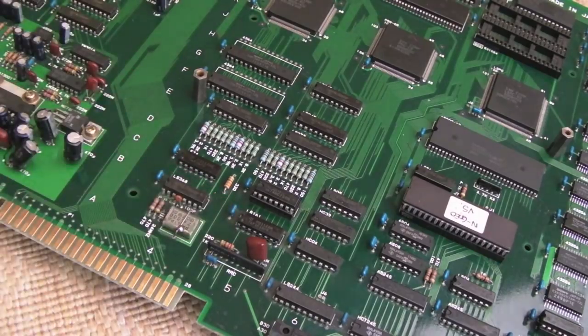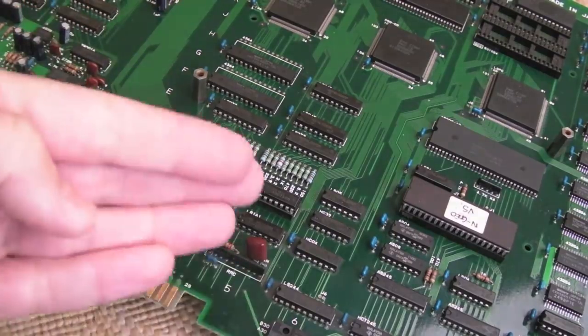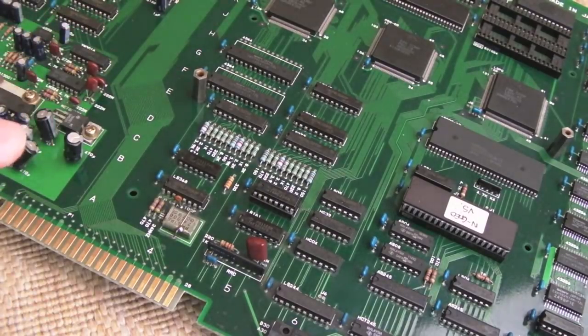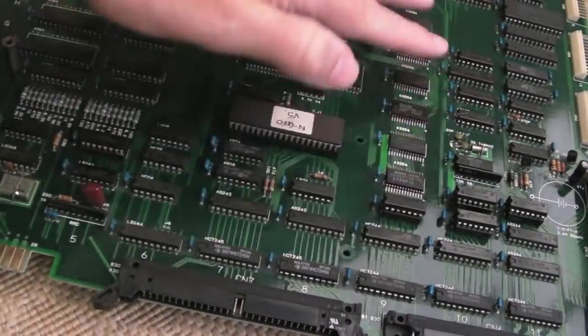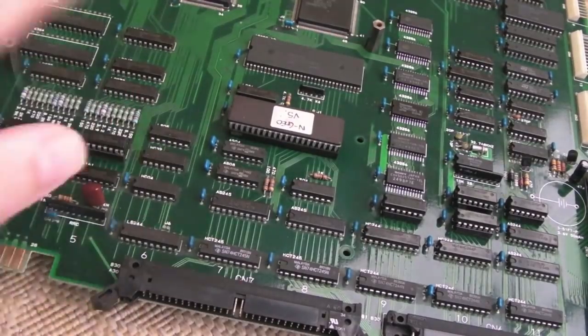And I went away for a few minutes, came back, switched the ATX power supply back on, and it was okay. I've had problems with that power supply like that before. I think when you get a short, some sort of cut-off happens, and if you don't switch it off for a good 30 seconds, you can't switch it back on. But at that point, everything was okay. I then went over and looked back at the SRAM side of things, and I'm glad I did, because that was ultimately the cause. And I never thought anything else about it.